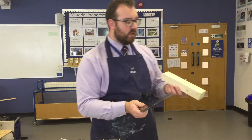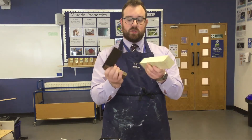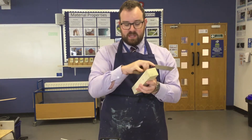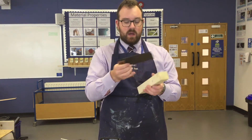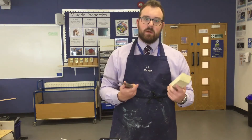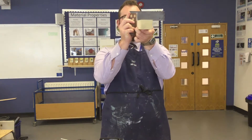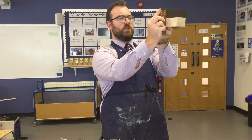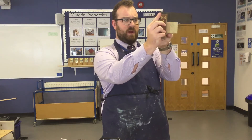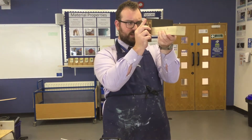I'm going to use the light from the window in front of me. I'll hold my tri-square up against the short edge — the butt of the tri-square goes against the shorter edge, and the metal blade runs along the face. I'm checking to see where it's most accurate, most 90 degrees. I put it on the edge, slide down, and move the square along. I've got a couple of gaps here — it's not quite 90 — so I spin it round and do the same thing, looking for a flat base.